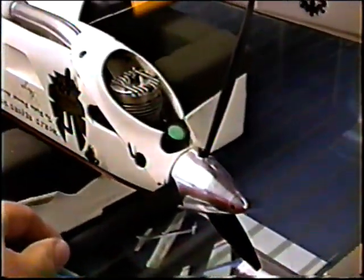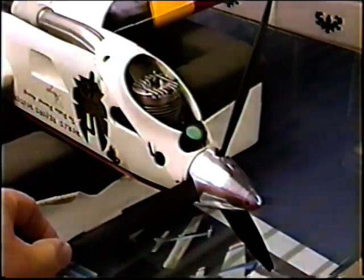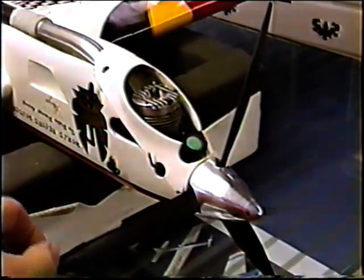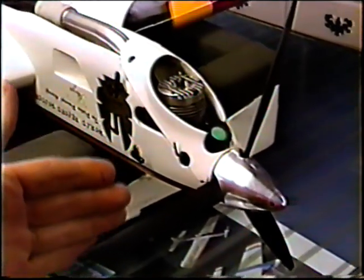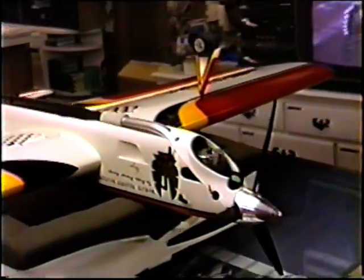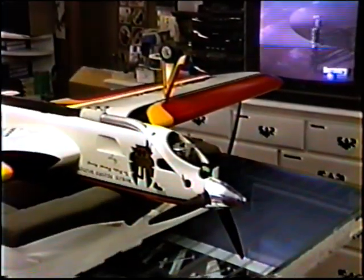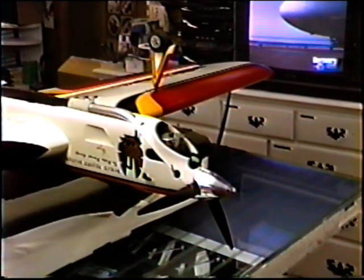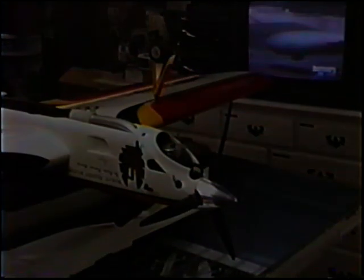But basically we came out of this with the Bill Lee prop. Even though the 4-blade did work okay, the Bill Lee prop certainly seems like it's going to be the better of all of the ones that we have pitched now, but it also gives us a real good gauge for where we want the load on the motor. This motor has a lot more ability to turn big propellers than the 50, so we want to take full advantage of that if we possibly can. So next thing, I'll pull the powertrain out and shim the tank.